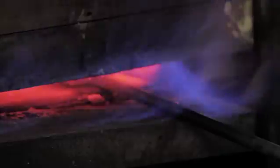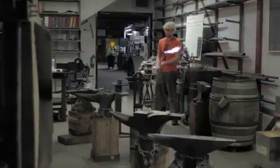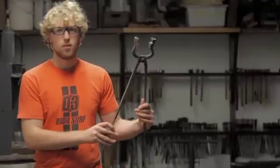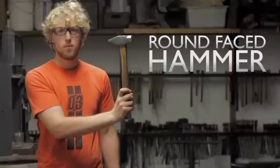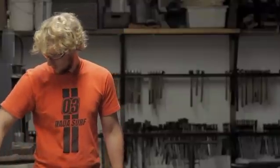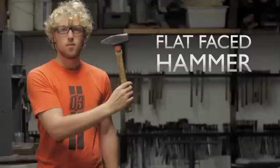Let's review the tools we will use to mold the metal into the knife. These are 1.5 inch box tongs to grab the pieces of steel. This is a German style round face cross peen hammer — the round face allows the strike to move and distribute the material across the surface, good for bigger areas and general shaping. For more specific and detailed strikes, the blacksmith uses a flat-faced hammer, whose perpendicular strikes produce more equally distributed deformation, used for finishing touches or refining the shape.